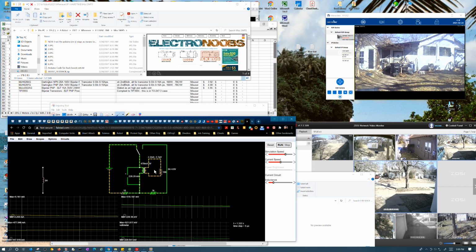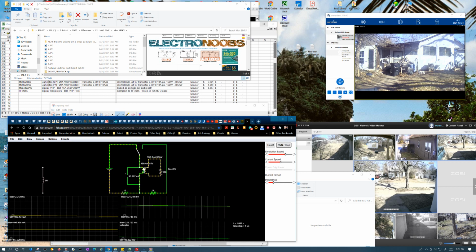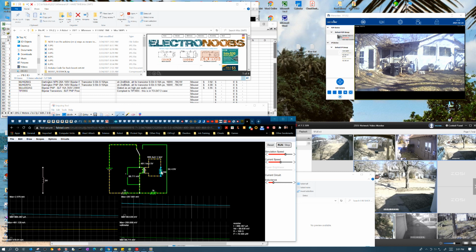I mean, less and less of that's going into the resistor now, and more of it's going into the magnetic field. So that makes some sense, that at first it's acting like a resistive load. At the very instant we switch it on, it acts like a resistor. That's why we see 50 milliamps go through this, and it peaks at 50 milliamps, going from zero instantly to 50 milliamps. It behaves like a resistor at first, because this is seeing 5 volts across it, okay,